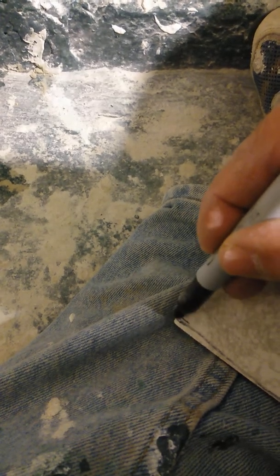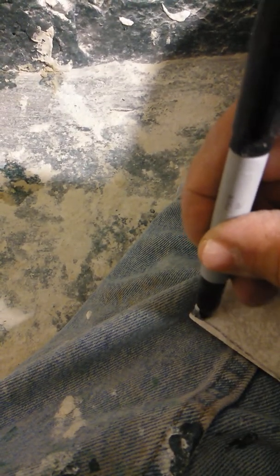Okay, so now the next step here is to get this scribed. So I've got this lined up here with this edge. And next I'm going to scribe it in down here at the bottom, starting on the far end. Making sure that everything's nice and tight. So I'm up about 3/16 of an inch here on this edge. So I go from this point right here to